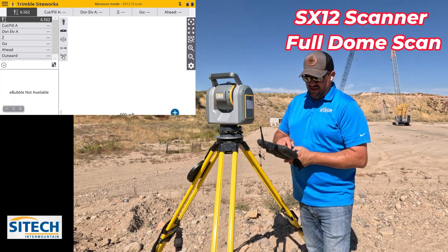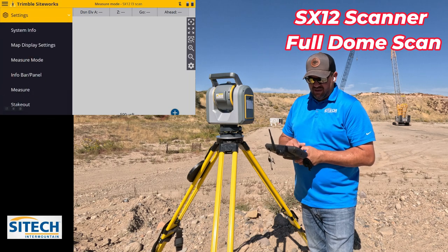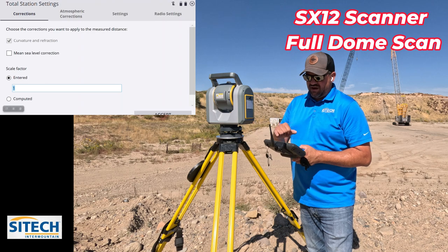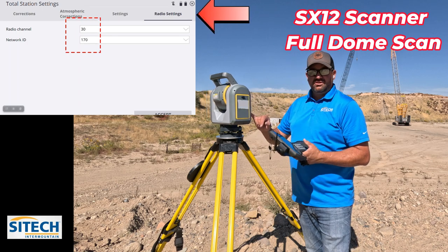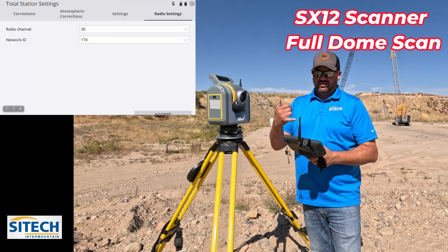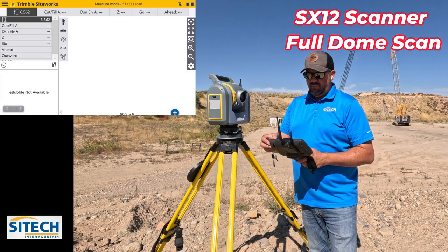Once you're in here, if you need to know what the radio channel is for it, or you need to set that, you can go into your menu button on the side here and go down to settings, and you can go down to total station settings. And in there, you can go to the settings right there and radio settings and actually see that this one, if you're traditionally used to using the radio channel, is at 30 and 170. You can change that right there to assign this a number. I'm going to leave it on Wi-Fi.